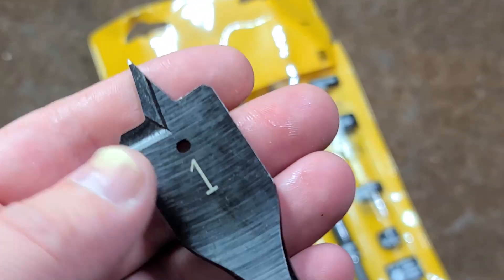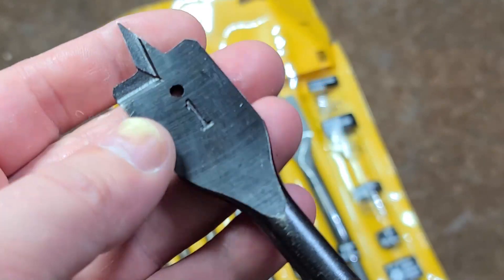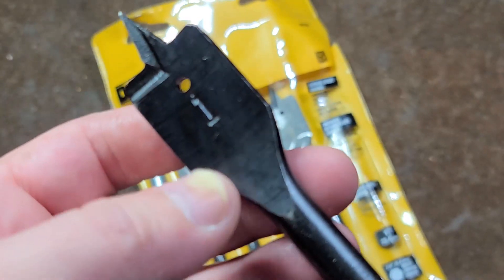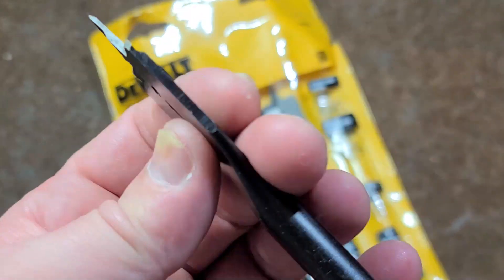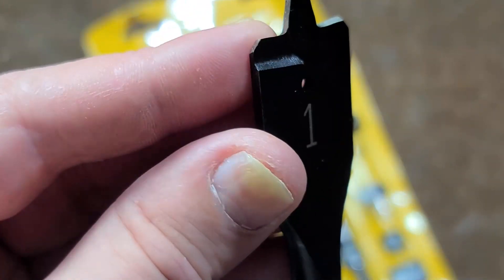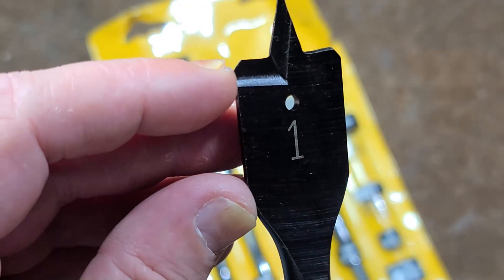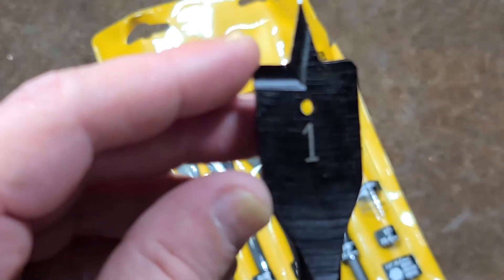Some things I like: they have laser-etched sizing on one side and a stamped size on the other, which won't wear out. The blades are actually ground — they've forged and flattened it out and then ground it — so it's going to be pretty decent. They also chamfered the corners, which helps them feed a little bit better and provides a better hole finish since it's not quite as sharp an edge.